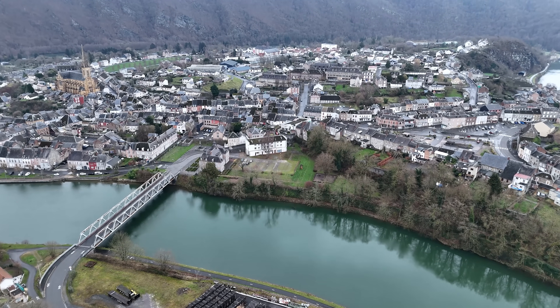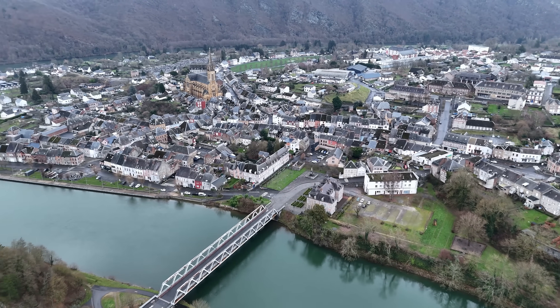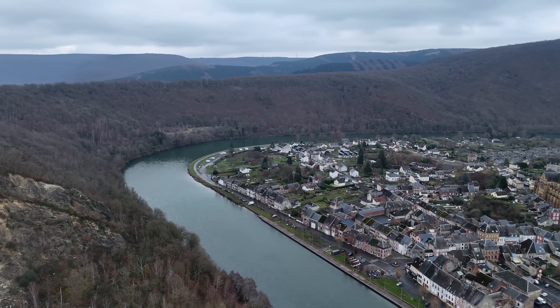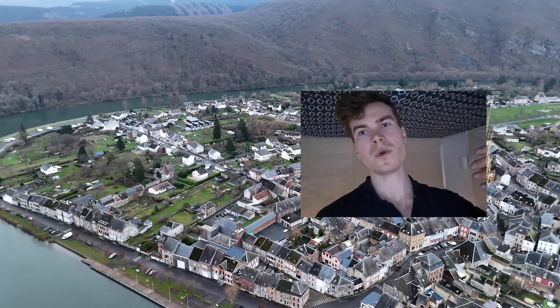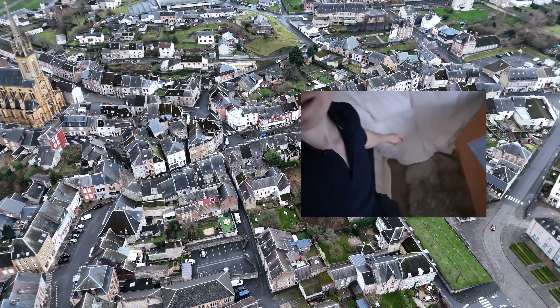Now that I know roughly the required energy to keep this space heated 13 degrees above the surroundings, I can go ahead and get my infrared heating. I think I'll get away with as little as 300 to 500 watts to keep the space comfortable. Keep in mind that infrared heating is far more efficient than just heating the entire room — when you have an infrared heater above you, that's going to be far more efficient. Next I'm going to optimize some of the surfaces, for example putting insulative foam underneath the floor mats, so I can expand the insulated cabin space all the way back — getting a total of roughly 7 square meters of warm cabin even in winter.